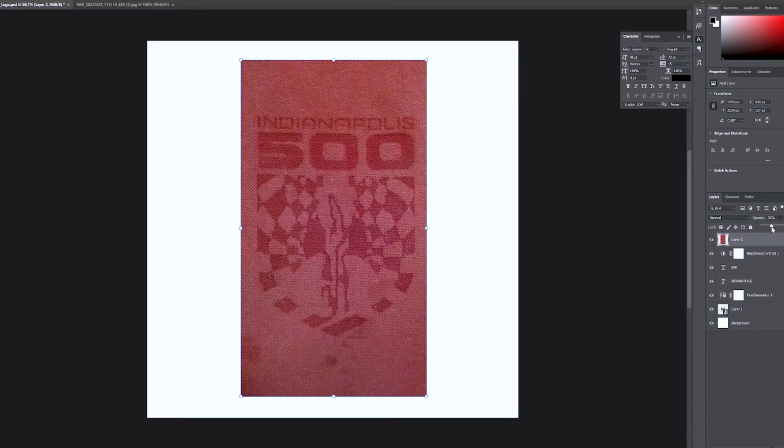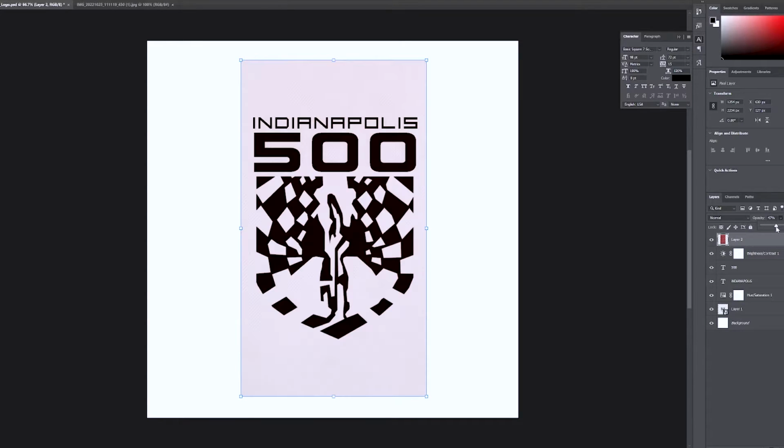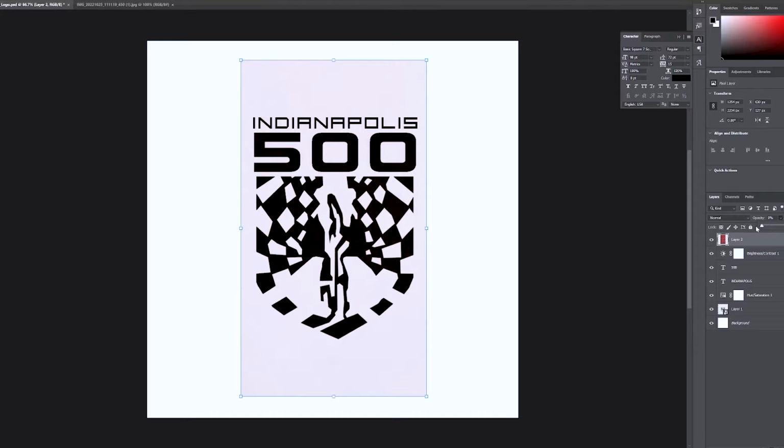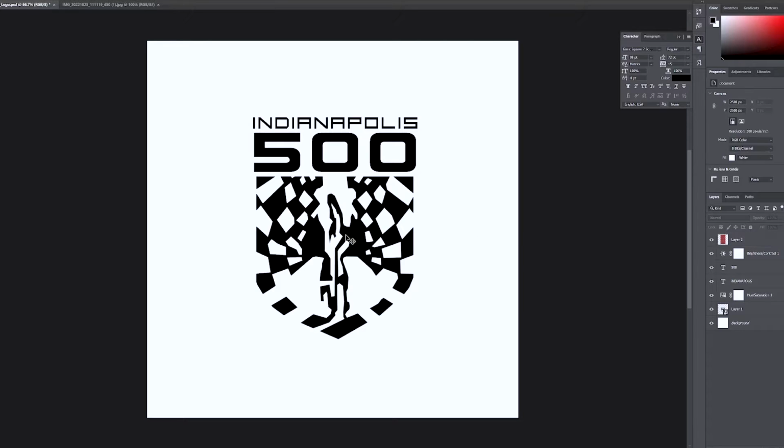In order to process this on the laser, I needed to bring the picture into Photoshop so that I could trace it out and create a vectorized form of the logo so that I could properly scale it. And since the original photo lacked quite a bit of contrast, I had to do all of the tracing manually. It didn't take too long, but in the end, I was able to come up with a very clean logo to work with. And in order to get the vector files, I did have to import this eventually into Adobe Illustrator, but you could also use Inkscape, which is free.